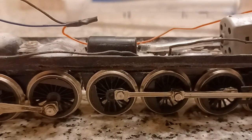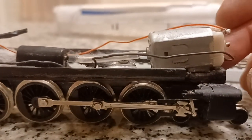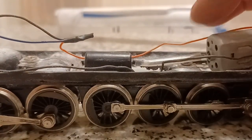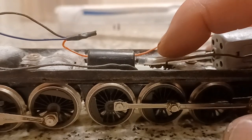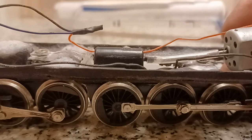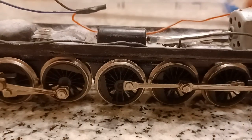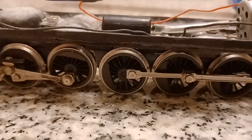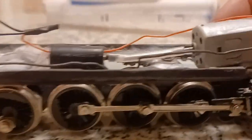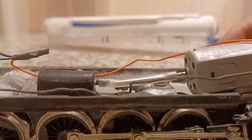This is front heavy when I push on this, because of the weight and where the pivot pin is. Ideally, it would be here. But I wanted the rear end to articulate more than the front. I didn't want the front end swinging way past the body. So I needed a happy medium. But in doing that, I screwed the geometry up as far as weight distribution goes.